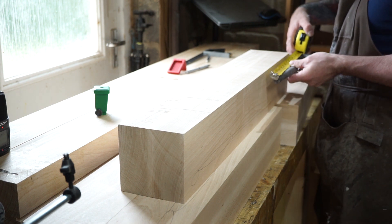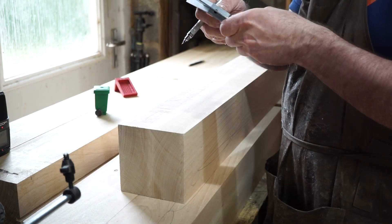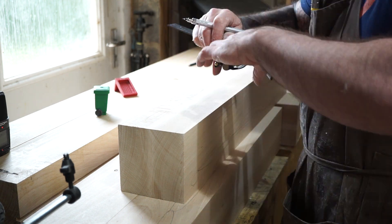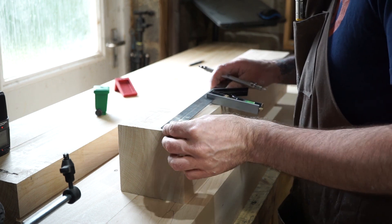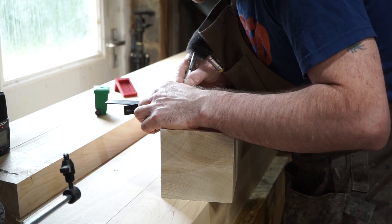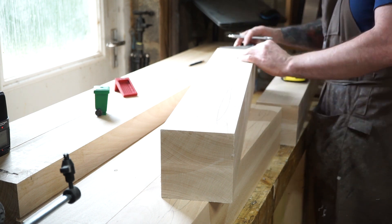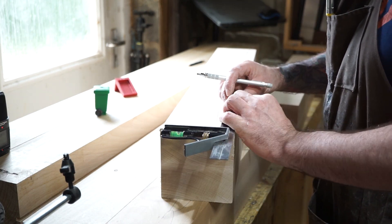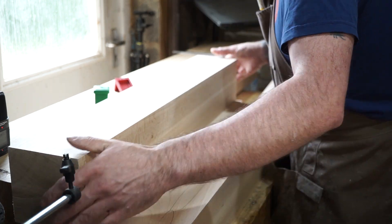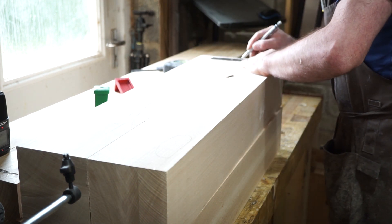I've sped up the footage here as there isn't a great deal to show. When using a hollow chisel mortiser you only need to mark out the start and stop points of the mortise if you're going to cut it in one pass. On this project I had some mortises that were going to take three or four passes and some that were going to take two or three passes, with both widths of mortise being in different locations on each leg. Whilst the wider mortises are centralised, the narrower ones are offset, so marking the sidewalls helps me keep everything organised. The legs ended up being 119mm wide and 115mm deep. The larger mortises are 40mm wide and the smaller 25mm wide. All of them are 65mm deep and 85mm long — very big mortises to cut even with the hollow chisel mortiser.